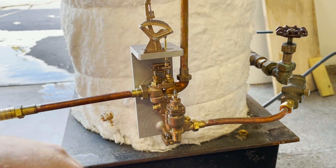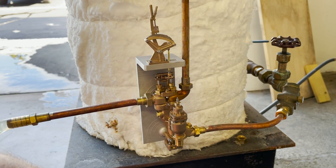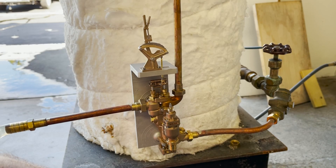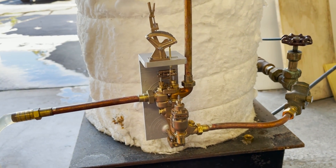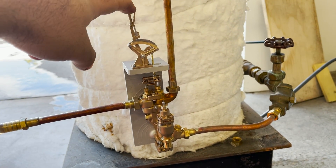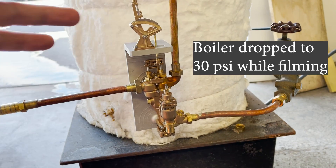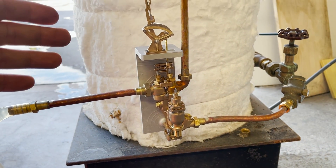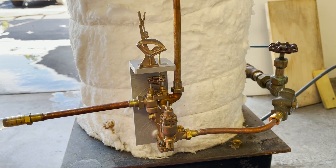It's really hard to get the water valve and the gap between the valve and the cage exactly right at these lower pressures — the volume of water that can pass through has to be exactly right. If you need to get lower than that, you can use a water valve on the tender to cut it back even finer. The nice thing is, say you're shutting down at the end of the day and you just want to open it up and put water in until the injector quits working — as long as you leave it open it should keep working all the way down to about 25 PSI. If you get down to 35 and shut it off then open the quadrant again it may not restart, but if it's going it should keep going until it can't go anymore.